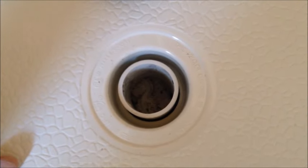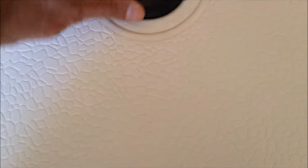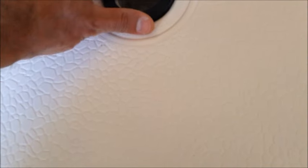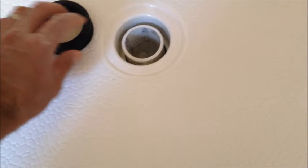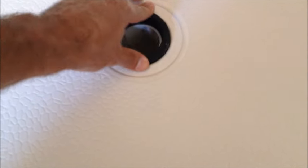You can see it kind of gets close in there, and then you would put this gasket on the sides. All that's between you and the water leaking into the ceiling below is this rubber gasket. We have a hallway directly below this shower, which concerns me a little bit. I'm going to investigate putting some kind of silicone caulk in there as well to make sure it's truly watertight.